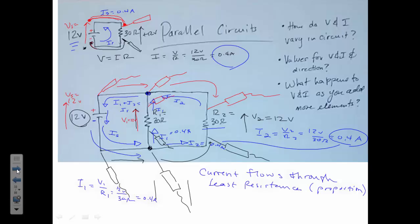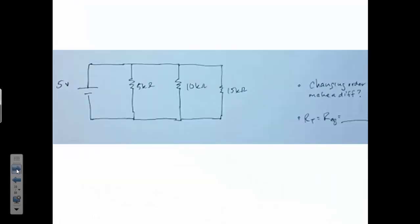So for parallel circuits: voltages in parallel are the same — that's the key idea. Currents divide proportionally based on the resistance in each branch. In this case the two resistances were equal, so it was an equal split. Currents divide in proportion to the resistance in each branch, and voltages remain the same in each branch. That's true for all parallel circuits.